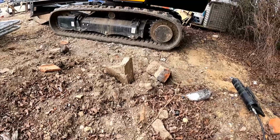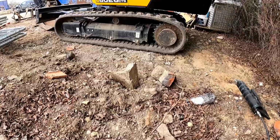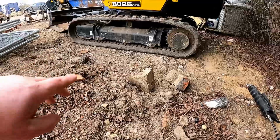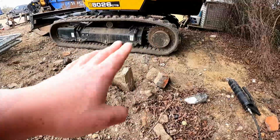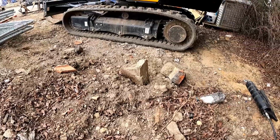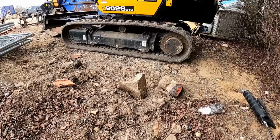My point here is that you just try and avoid, if you were, let's say, sat on a curb edge or something, and you had the machine half on the curb, half off, and if you put your blade down and you level yourself up a bit, you're maybe putting the pressure on an idler or a sprocket at each end, instead of that kind of sharp edge in the middle of the tracks. It'll make your machine life operating a hell of a lot better, you're driving better, and it'll also prolong your tracks a bit. So just be considerate of these things.